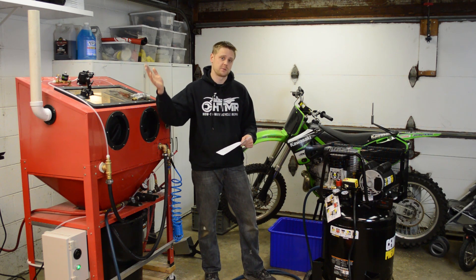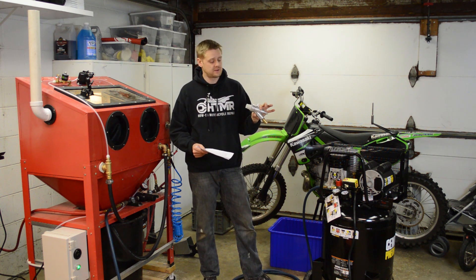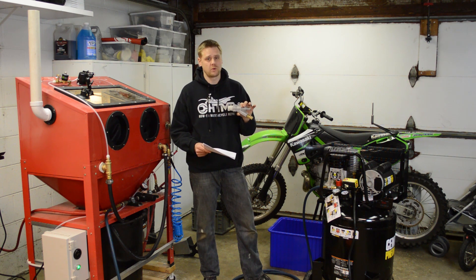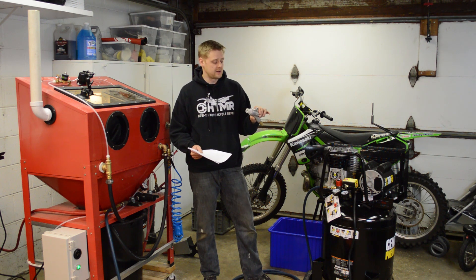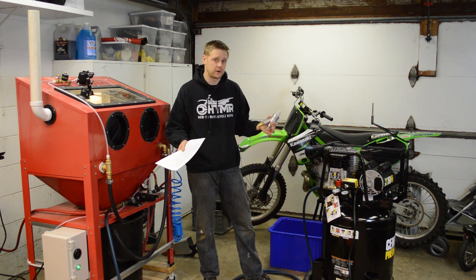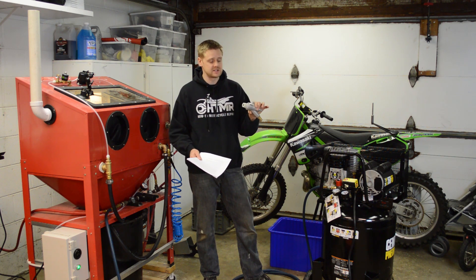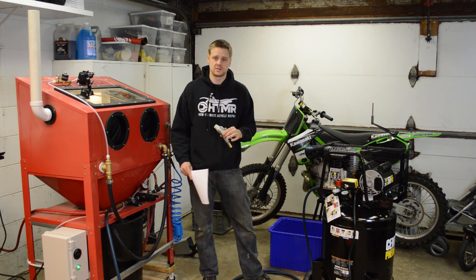Static pressure is obviously going to be a little higher because when you hit the pedal it drops a little bit. This gun here is off the shelf, however you have to modify it to work at 6 CFM — any gun off the shelf will consume way too much. The modification I do allows you to run any CFM you want: 6.2 CFM, 11.1 CFM — once you make the modification it's very easy to tune it to whatever you want, so you can tailor it to your compressor.